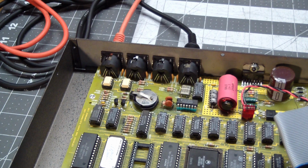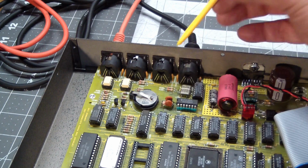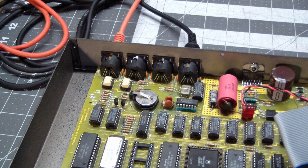And what happens is, once you apply electricity, current flows into these again, and if there is battery leakage in them, the corrosion will continue. Now, as I said before, if we have a trace that is broken somewhere in the middle that we've bypassed, we're okay, because the corroded part of that trace never gets to carry any current. It's interrupted, right? All the current flows through the new wire you put in.